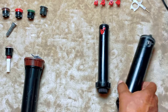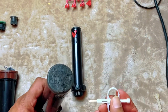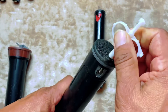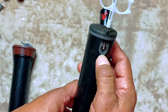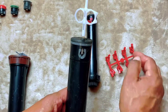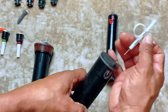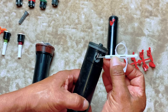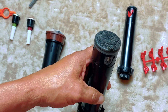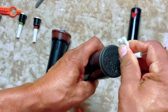There's a little tool that goes right in here and that takes out your nozzle insert so you can pick the one you want, remove it, and replace it. This tool also adjusts the arc. These rotors also go from zero to 360 degrees and you can adjust it right here.